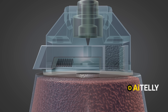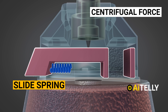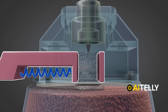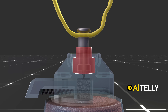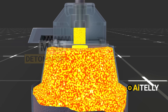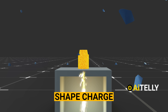Step five: this is where arming the grenade takes place. With the firing pin out of the way, the slide assembly becomes free to move. The slide spring and centrifugal force work together to smoothly move the slide assembly into the armed position, where the spring keeps it fully armed. Step six — impact and detonation: when the grenade hits its target, the specially designed inertia weight drives the firing pin into the M55 detonator, setting off the firing train. Step seven: as the firing train ignites, a shaped-charge jet is propelled downwards while the body of the grenade bursts into a multitude of tiny fragments.